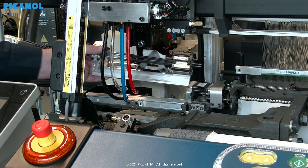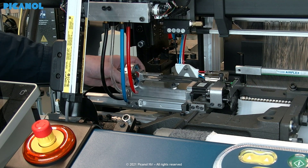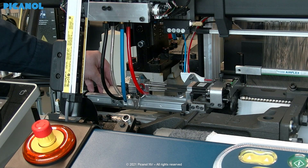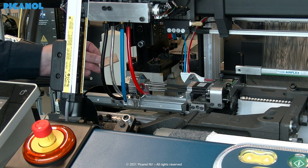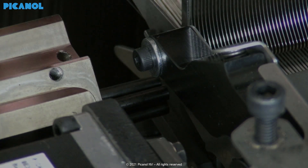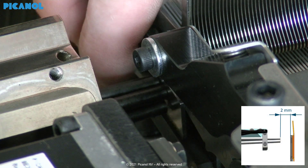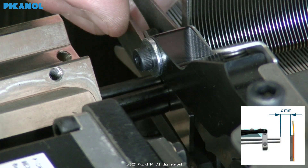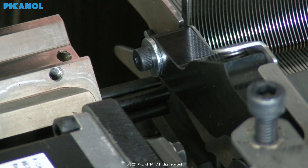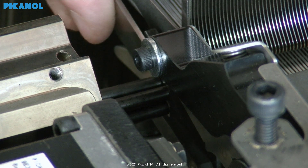Place the Posi-Jet. If there was a wooden spacer, replace it. Place the Posi-Jet two millimeters from the scissors. You can use the gauge for removing the relay nozzle air tubes as a spacer, as this gauge is two millimeters thick.